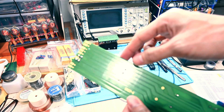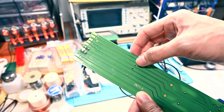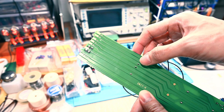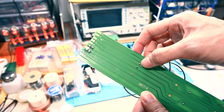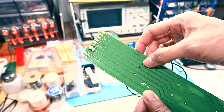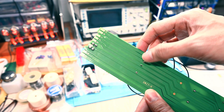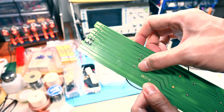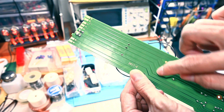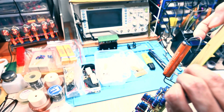So I drilled a hole on the back side — I drilled the hole here and used my rotary tool to sand the protective paint off the top of the copper because I need to solder the pin into the PCB. After quite a short while, I finally managed to install the pin and solder it to the PCB. I actually drilled the wrong hole — a bit of a mistake because I thought it was a straight line, but it's not; the line is actually bended to the other side. But anyway, that's fine — small error.